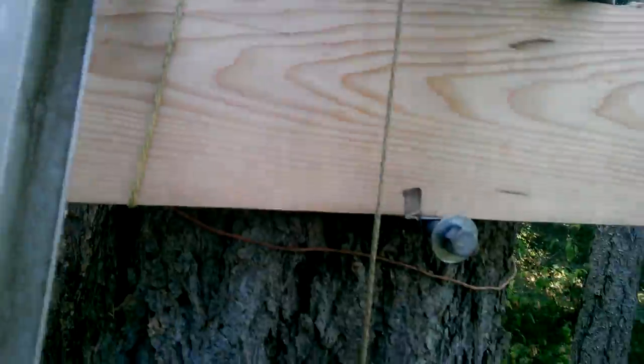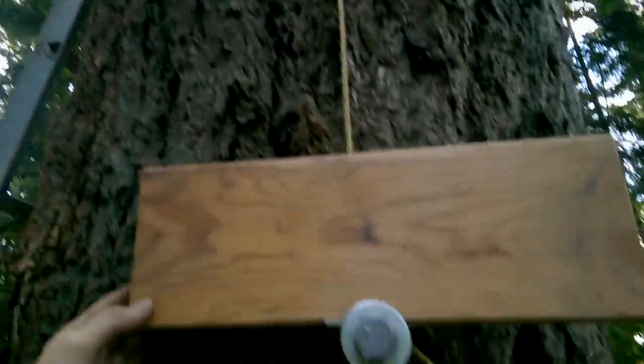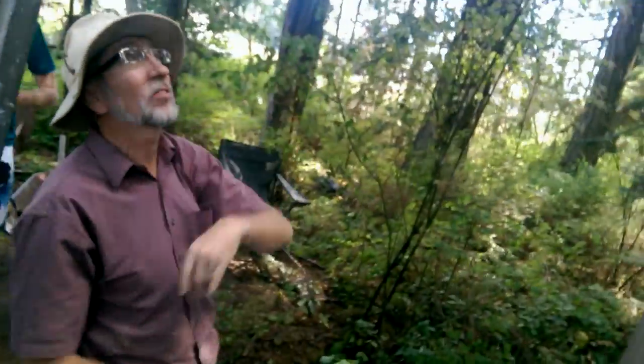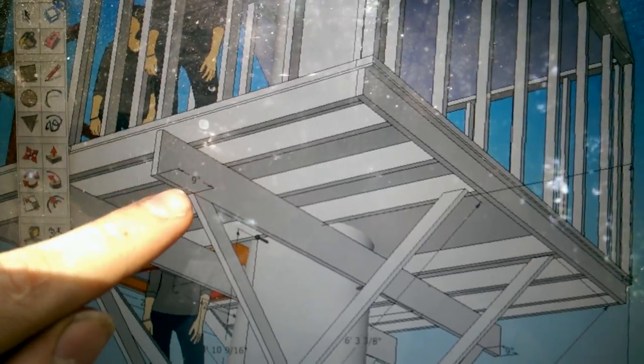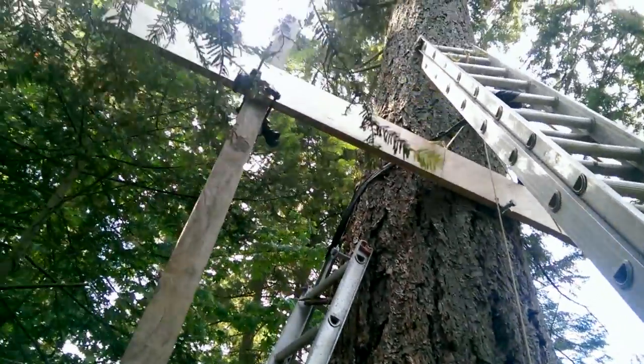You just put the bolt on. So now we're going to do the one on the bottom, and that's going to go with 45-degree angle boards to the top one. Because we didn't mark anything there, I don't know where it's supposed to sit. The 45-degree support — the distance we need is 9 inches away from the edge of that 2x10, which means I have to measure that up there, and then we can figure out how long to make the 2x4s.